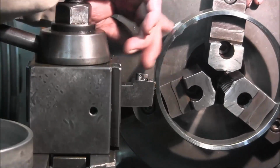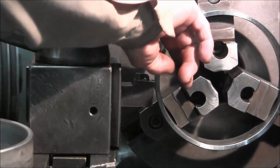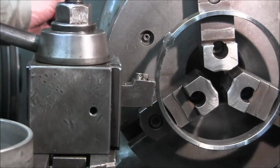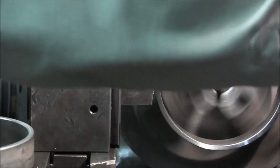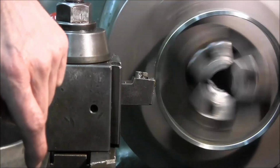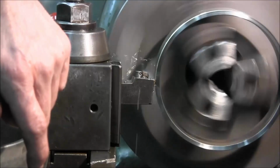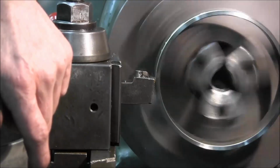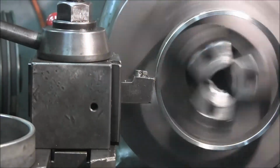Touching there. The weld's right here, almost skimming that off, touching a little bit there, touching a little bit there. So that's, boy, another 5 thousandths. We'll go 5 thousandths per side. I think we'll probably let that fly. Getting there, cleaning up to 100%.